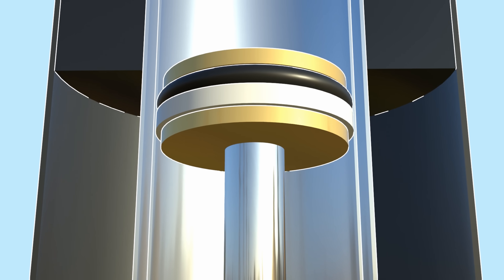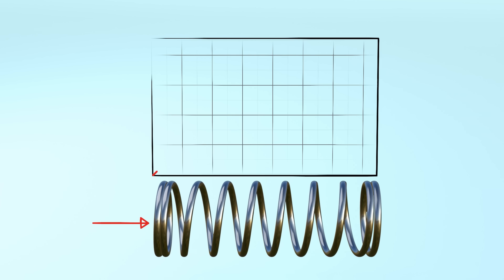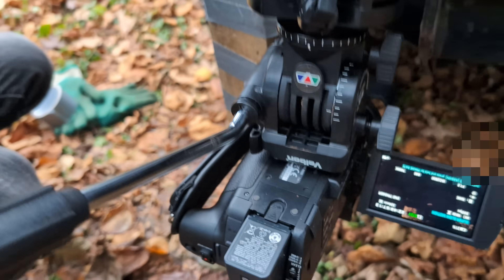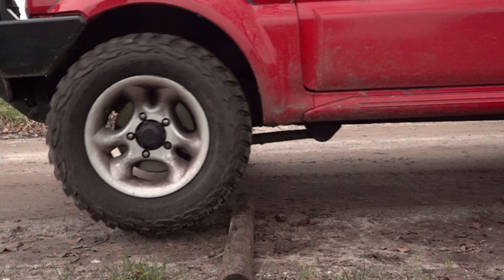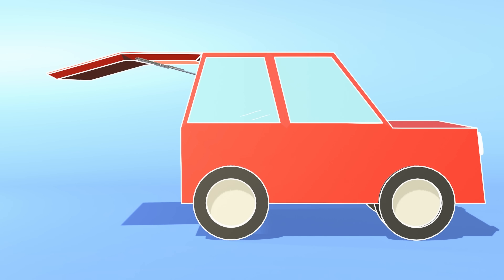This relation between the diameter of the cylinder and the diameter of the rod is also what determines its spring curve. Most springs, like coil springs, try to have a linear spring rate - one distance takes one force, two distances take two force, so it becomes harder and harder. That's very nice for holding up weight subject to change in a dynamic environment, like a car that can hold between one and five people driving over big or small bumps. But sometimes you want a constant force over the whole range of travel - for the trunk of a car, for example. You don't want it to slam in your face when you open it. In that case you want a constant force spring.